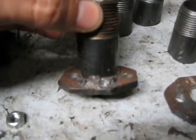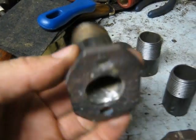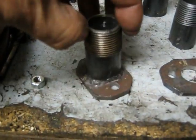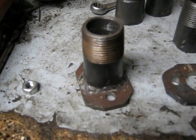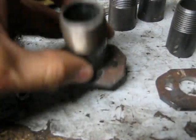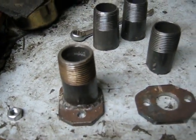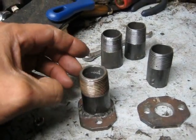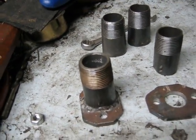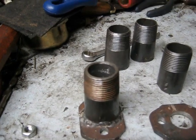When you weld it up it looks like that. From this side I often weld both inside and out, because generally you have to grind off a bunch of the weld right by the bolts. Even using Allen head bolts — cap screws I guess they call them — it's a tight fit for the bolt, so that's why I also weld on the inside especially at that point. It's kind of crude but it works. The purpose of the thread is to allow me to remove these and reuse them for different engine configurations. You could do it without a thread, but it gives you more flexibility in taking it back apart.